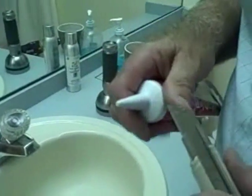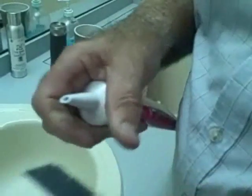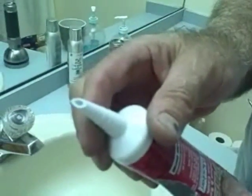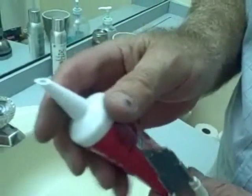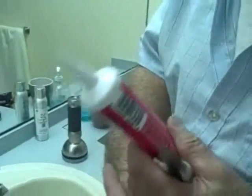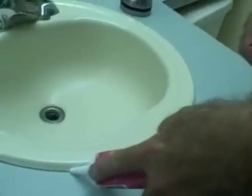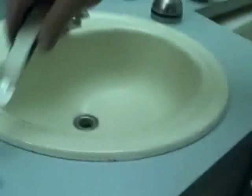The other thing we're going to do is cut our opening on it, and we don't want a real big one, so we cut an angle — a 45 degree angle — so that when we put the caulk on, it flows on nicely. The other thing we do is square off the top and make like a shoe out of it, because when we go around and caulk, it'll actually help put itself in. I'll show you that here in a second.